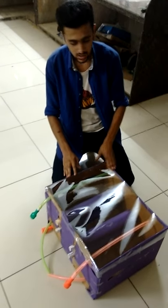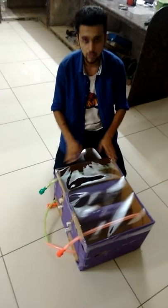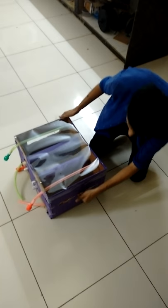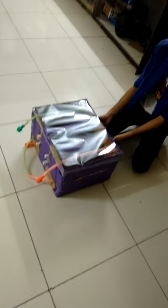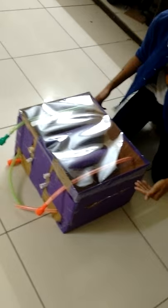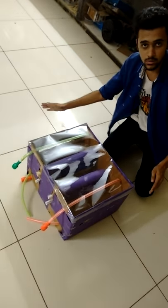What we have made is a kind of dishwasher. It's not the original model but we have made only a prototype of it. As you can see, from here we will put the dishes in it and there is a roller mechanism which consists of brushes. As you put the dishes in, the upper two rotors move anti-clockwise and the downward two rotors move clockwise, and hence the dishes move ahead and finally come out of the dishwasher.